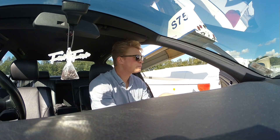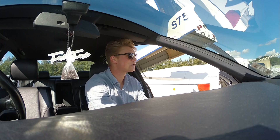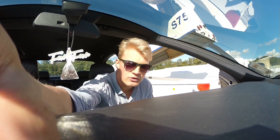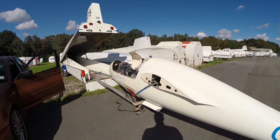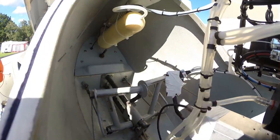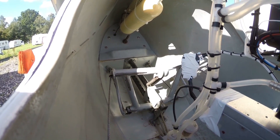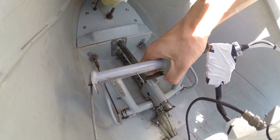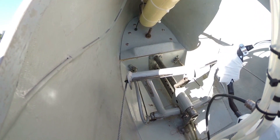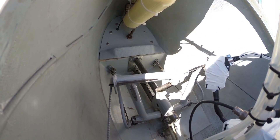We've arrived at the glider and just had the first inspection. We checked the fuselage and all the connections for the wings as well as the tailplane. So this is the plane we're talking about — a standard Cirrus 75. Here in the nose of the glider, these are the rudder pedals. The intention is to use all that space to house the motor — that cap comes off, we'll take out all the mechanics for the rudder, then chop the nose off at roughly where this wall sits, and replace it with a new bulkhead which allows us to mount a motor to it.